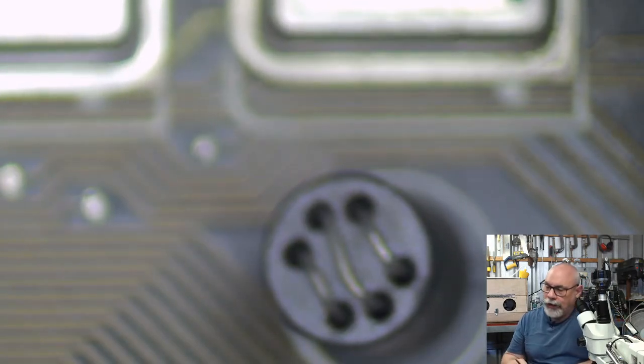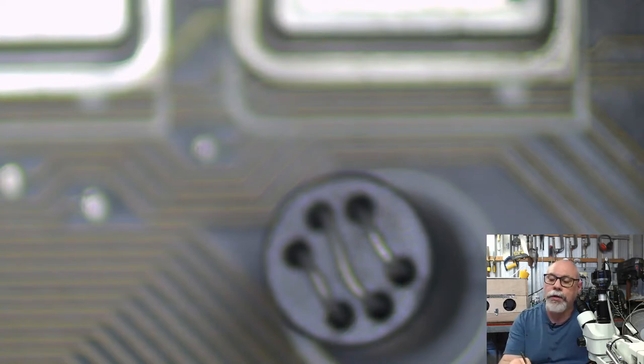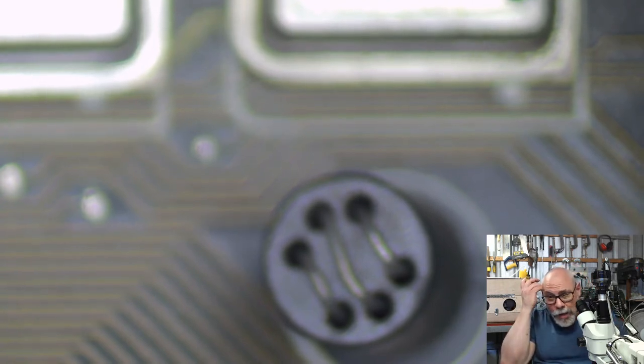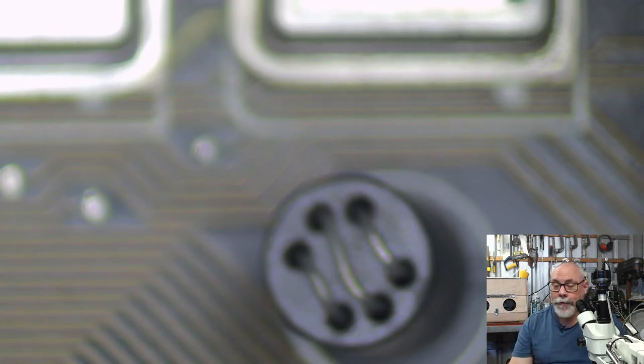Now I can get rid of my gigantically huge tip. So is this also called a 3C tip? This one here is the one that I use typically, the main tip that I use, a T12 BC2. I do have links to that in the description, I'm pretty sure. The great big one is a T12 C4. Now, if you ever happen to be on Hakko's website, there is a dizzying quantity of tips available to buy. What I would generally suggest, if anyone does have a soldering station like this, is jump onto eBay. You can actually buy copy tips, non-genuine Hakko tips, T12 tips not made by Hakko, and you can buy them in kits of like 10 or 15.